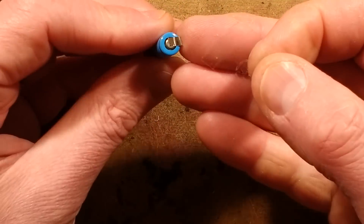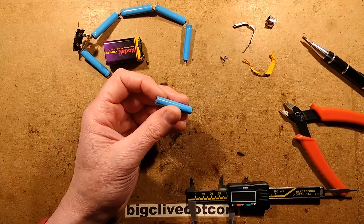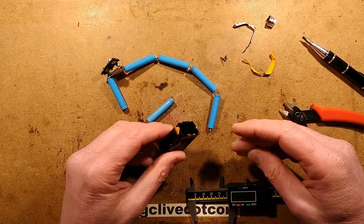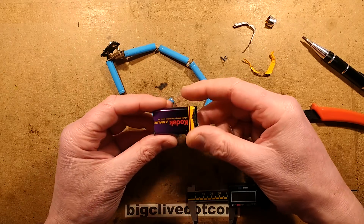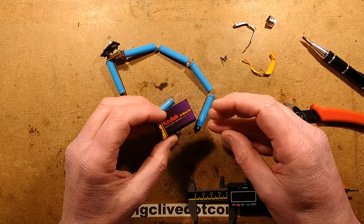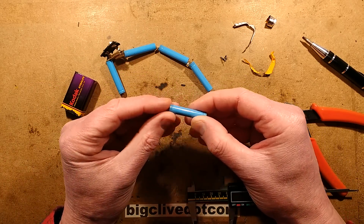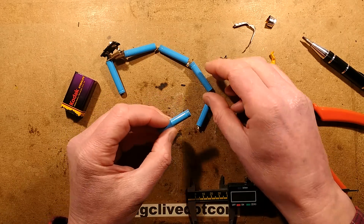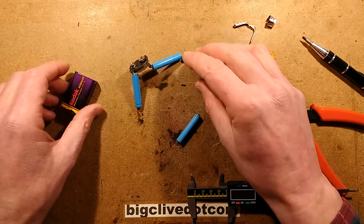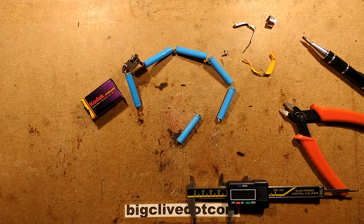So the answer is that in some applications, if you're looking for quadruple-A cells, it turns out that you may actually be able to get them from inside one of these plastic battery housings from Poundland. The capacity of these is typically around 500 to 600mAh, and they are just standard alkaline cells. The fact they're sleeved is surprising — I suppose it just makes it easier for assembly. So that's what's inside one of Poundland's PP3 batteries; it might be a handy source of these little compact alkaline cells.